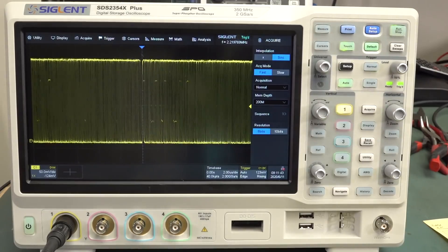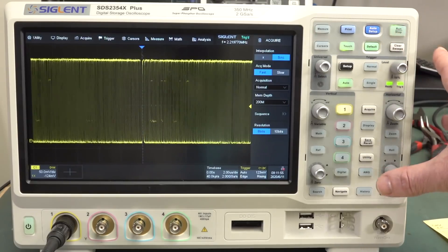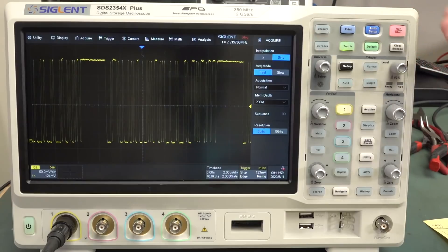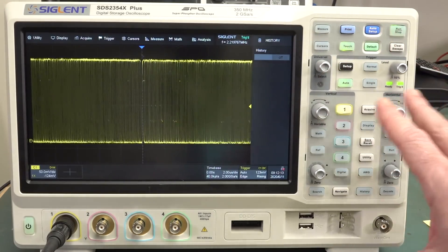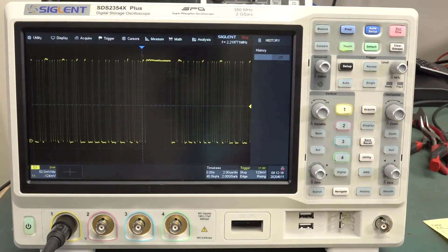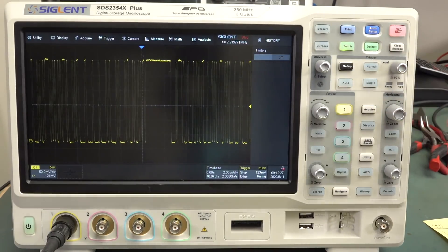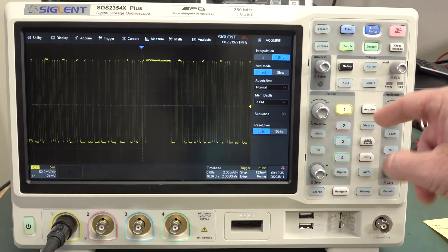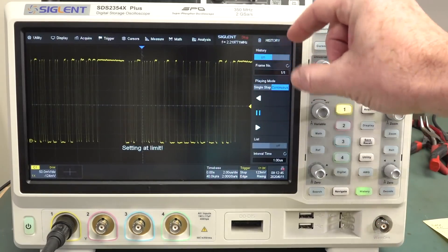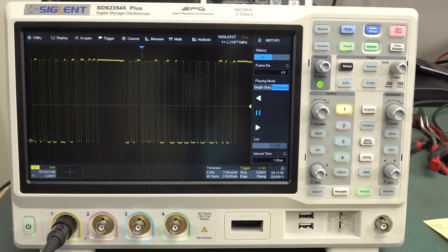You would think that for run/stop mode, okay, this is probably not an unreasonable choice — it could actually be very helpful to have history always on. So when you do run/stop, you've got all the frames in there. But when you've set up your horizontal, your trigger, your vertical, everything else, and you're ready to capture your signal and you do your single shot capture — it should switch out of this 40K or 100K points and give you your full 200 meg. But even in single shot capture mode it will not do it. It actually disables history in single shot mode, but doesn't then give you the advantage of the extra deep memory.